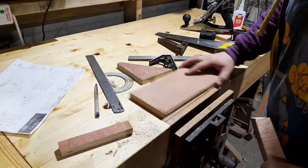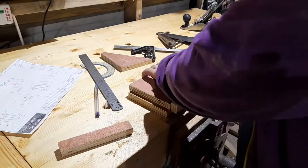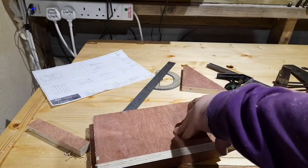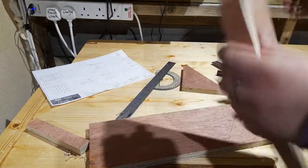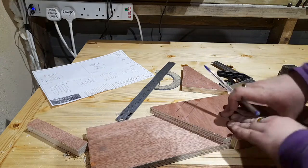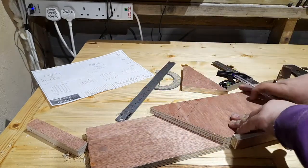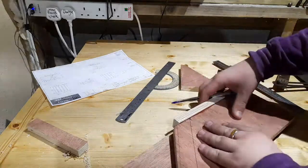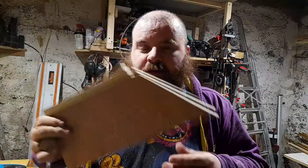That means then that every time we score that angle, it's cutting off the same piece, which means it's always going to be the same angle. And because you have that fence sticking out both sides, you can repeat it, use it on whatever side you need. The really important factor is not necessarily having it at the exact angle that's there, but matching all the angles.